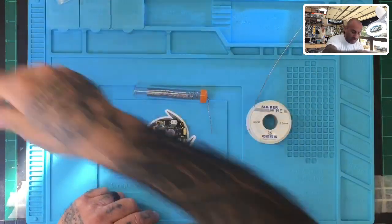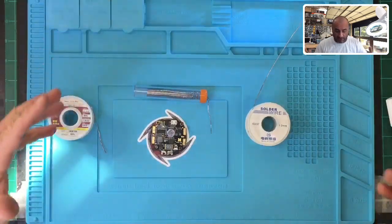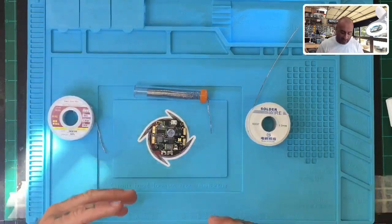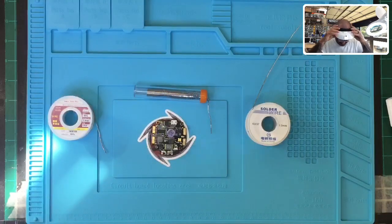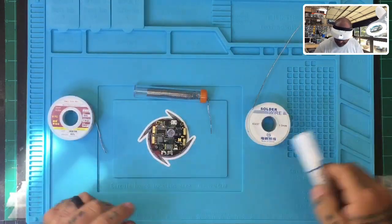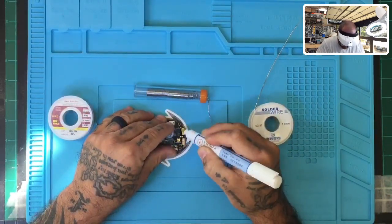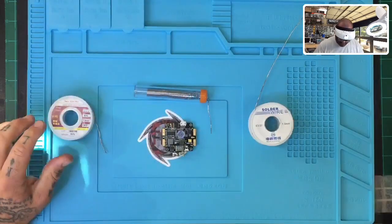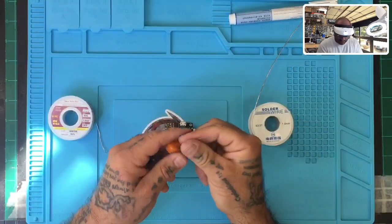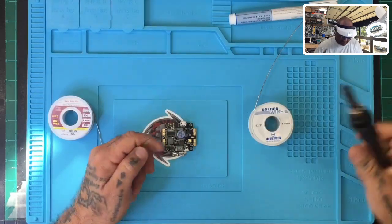The really important thing I wanted to show you is this solder. A lot of you have heard stories, or even bought soldering equipment that's not good — the solder is terrible and makes your solder job look terrible. I'm going to show you the differences. I'm using a 951 no-clean flux pen to prep both sides. I'll start with this portable solder — it's supposed to be 10 grams of 63/37 solder that you can take outdoors.